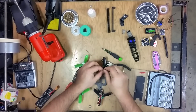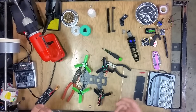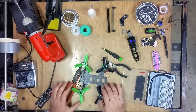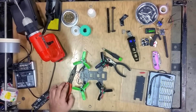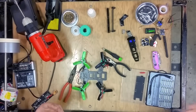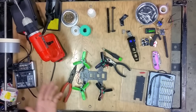Something I'll explain right now: I'm going to remove the red and black smaller wires — these look like 20 gauge wires — from each ESC. The reason is that some ESCs have BECs, or battery eliminator circuits, built into them. When you see an ESC labeled as 'opto,' that means it does not have one. A 5-volt BEC on an ESC is really for a different application — like an RC car or RC fixed-wing — where the ESC provides 5 volts back to power your receiver, flight controller, or servo.